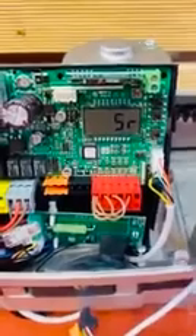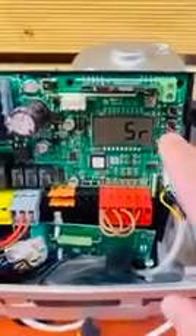The motor will come factory set to RH — right hand — so let's scroll back down to LH left hand and hit OK. The preset when you get it out of the box will automatically be set to AR — Automatic Residential. You don't want that because it means it will automatically close after about 10 seconds, which you can adjust, but I'll go into that another time. What we want to do is hit the middle button once to change it to SR — Semi Residential — which is click to open and click to close, the safest way to go. Hit your OK button to accept that change.